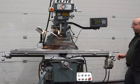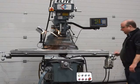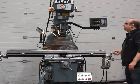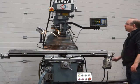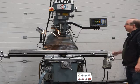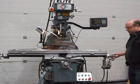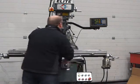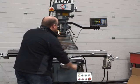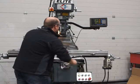You should be able to see the X-axis moving on the digital readout system. There's almost no backlash — this machine has hardly been used at all. It's got safety handles on the X-axis as well, so they just spin when you're under power feed. On the Y-axis there's very little backlash, it's nice and smooth all the way front to back. You can see the DRO moving as I move the scale.